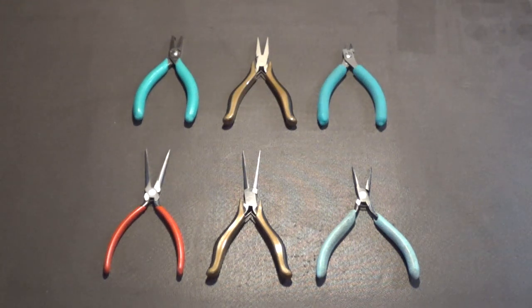Okay. The middle set of pliers up there are flat nose pliers, and they're used for straightening out the metal tabs on shielding that you fold back down. Sometimes you have to fold up these tabs to take off the shielding, and those pliers are perfect for straightening them, making them perfectly straight and flat. They're also great for straightening out the leads on electronics parts if you want the leads straight and even with one another. This includes the legs on integrated circuits.